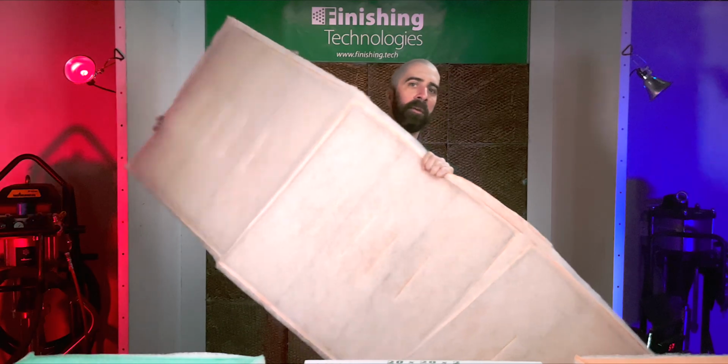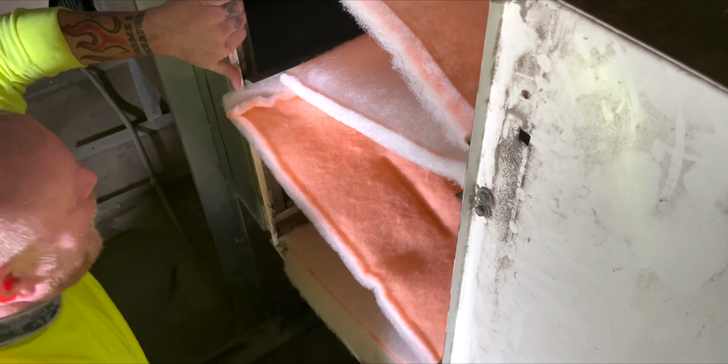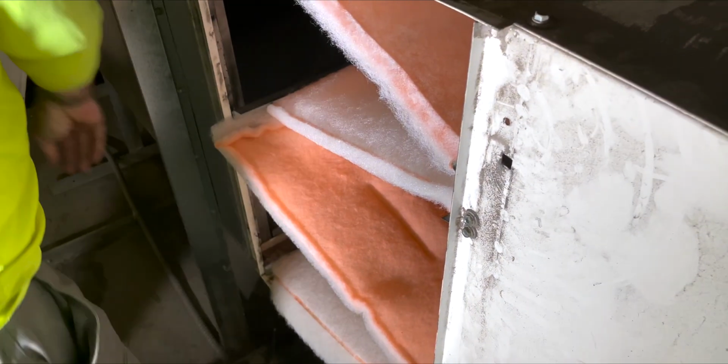First, if your intake plenum is a wide area requiring several to be installed in a row, linked filters can just be pulled out of a long track without having to reach inside to retrieve individual panels or searching for that perpetually missing retrieval tool. Second, if your intake plenum requires the filters to be installed in a zigzag pattern, linked panels will stay together during installation and removal. This should make installation easier for your shop, and while linked filters are more expensive than single panels, this feature may reduce your job downtime and save you on labor too.